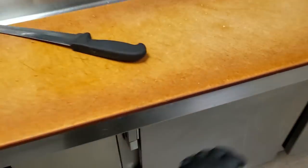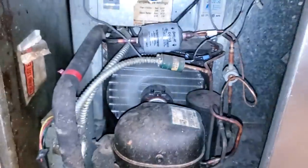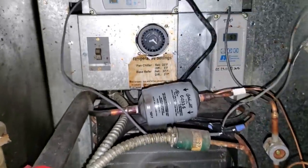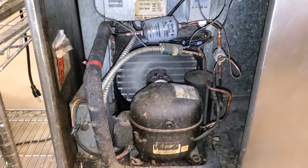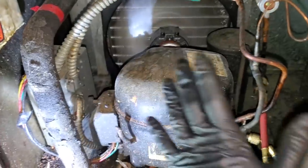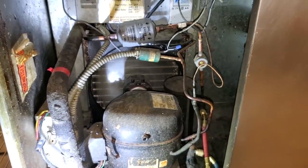We have a complaint of a reach-in that is not working properly. The top and the bottom are high in temp. We've got a flashing sight glass — top is at 39, bottom's at 57. We're going to dive into this. Probably have to top off the charge and find a refrigerant leak. The head pressure's rather high for being low on charge, and there's a lot of heat coming out of here, so I'm thinking we might have a dirty condenser also, but we still got to clear up that sight glass.